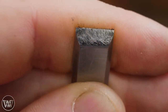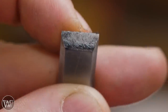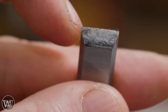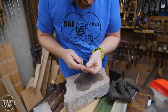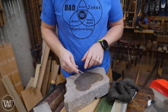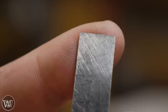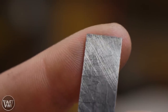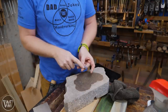I want to look at the scratch pattern and make sure I have scratches going all the way to the edge. I also want to make sure I've got a burr on the back — I don't need much, just a little bit. I want to make sure those scratches go all the way across. I've got a little bit more to do on this corner over here. After a little more work — yeah, that's what I'm looking for. Normally I wouldn't touch the back because it would be nicely polished, but in this case I want to show you I can do both surfaces. You can see the scratches left on the back — it's really heavily scratched up. Because we last did the back, I can now feel the burr on the bevel side.